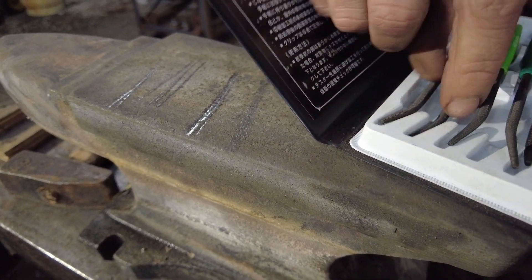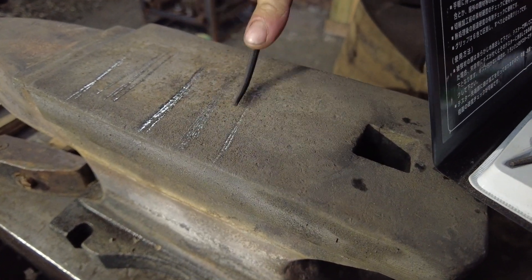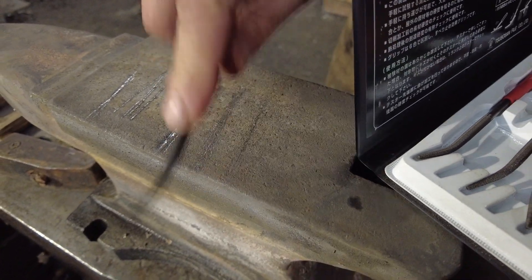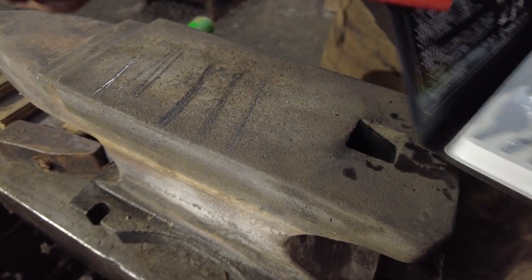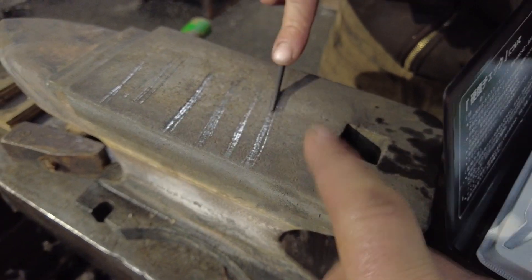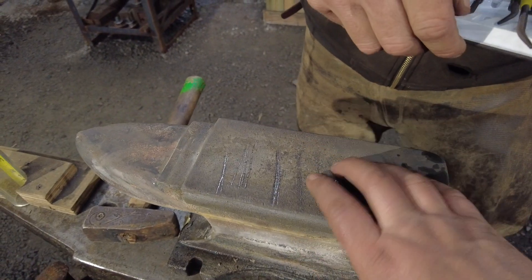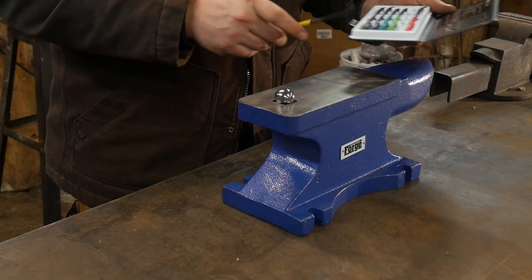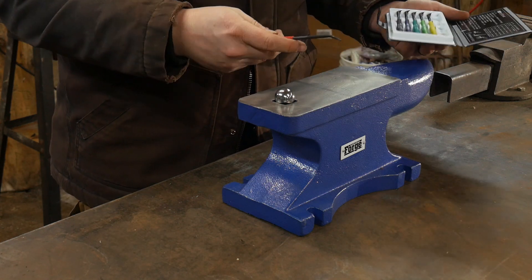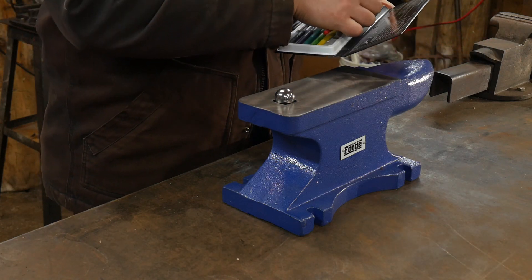At 45 Rockwell: that's mostly skating, just removing surface oxide — scratching but not a lot. Down to 40 Rockwell, and it's just lightly doing it — removing the forging scale but not biting, just skating on the surface. So it's anywhere from between 40 and 45 Rockwell. In the previous review video, even down to 40 Rockwell the file just glides as if that face isn't even there, like filing on Play-Doh. And this kit bottoms out at 40 Rockwell — so before, it was definitely below 40 Rockwell on the C scale.